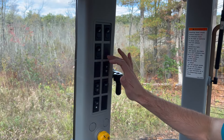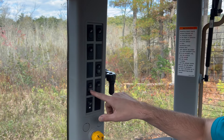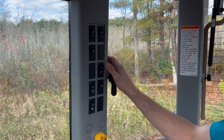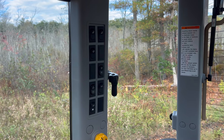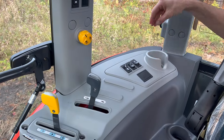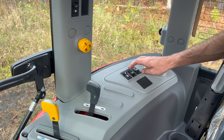Over here, there are a bunch of different buttons and open slots for options. These are all cab lights — front and back cab lights, front window wiper, and rear defrosted window. You have cruise PTO with incline and decline on the RPMs. This incline and decline here is for the physical engagement of that hydraulic clutch system — pressing it up will speed up engagement when you go forward to reverse on the shifter, and turning it down will slow it down. Bunch of cutouts again for other buttons if you need to add some.